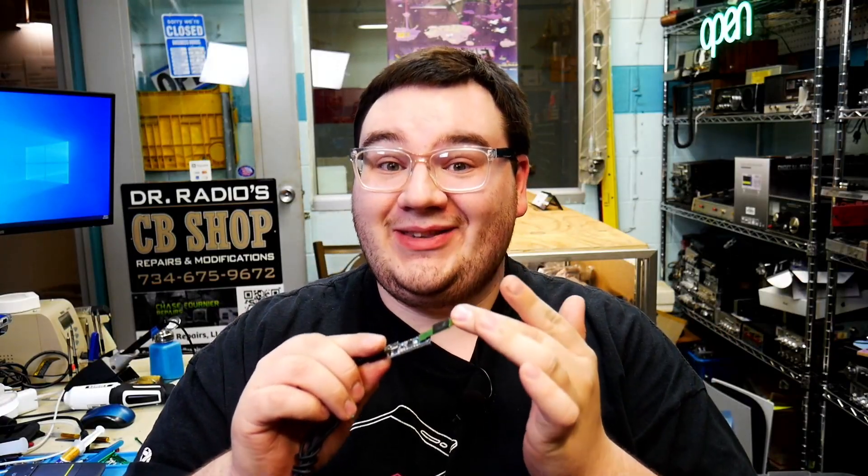I did go ahead and test this EMMC and it turns out this is actually the bad chip that I had laying around — I didn't sort them out, so it is what it is. But I do have the hardware reader where you can connect it directly to a computer and read and write to the chip, which is great. That's how you re-ball an EMMC, or really any chip that requires BGA rework or re-balling. If you enjoyed this content, you should totally subscribe.